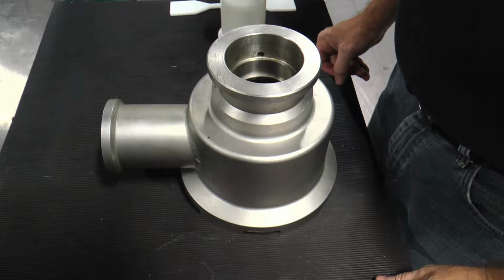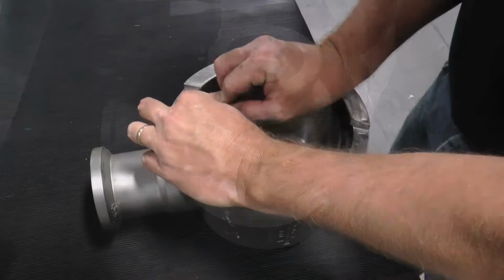Take special care while cleaning and maintaining the bearing and seals to ensure that these areas of the shaft are not scratched or damaged. A bent or imbalanced shaft will cause premature bearing, seal, and blade wear and may damage tube walls. Check the shafts annually for straightness and balance.